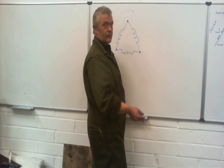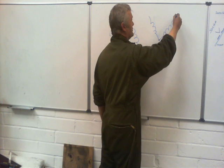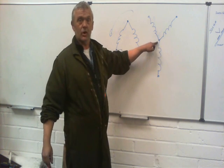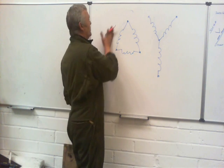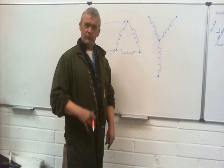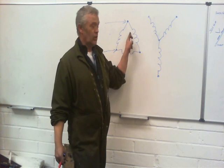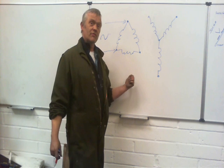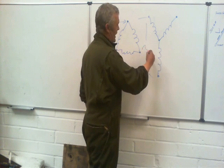There's another configuration called the Y configuration — it looks like a Y, but it's spelled W-Y-E. Here we have our coils with four points of contact, where one is actually common. It's the other three that we're interested in. On a three-phase motor each one is powered separately. If we want to run this as a single phase, we can put our single phase in at two points and it will run, but dropping out one of the coils — so it will run kind of lumpy. It won't self-start; you need to give it a bit of a spin and the momentum will overcome that dropout point.